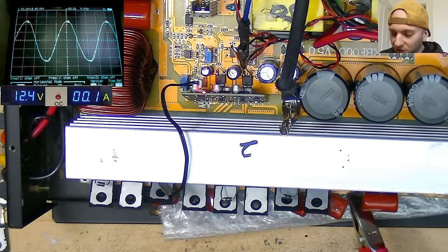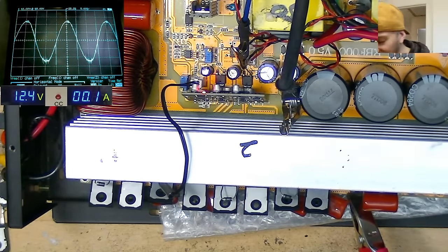I just soldered all these back in the board. I didn't need to remove them. I just needed to put diodes across them. Bit of a waste of time, but it's all a learning curve, isn't it? At least I now know that if these go bang or aren't happy at the higher rail for whatever reason, these DG50X ones are really, really happy in this circuit.